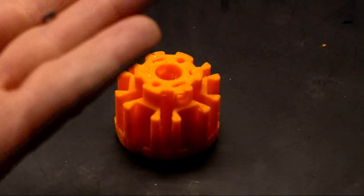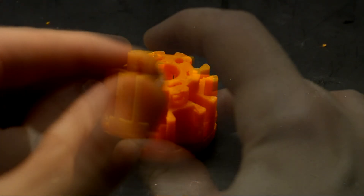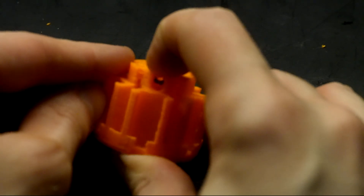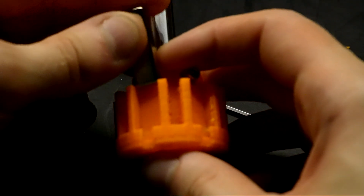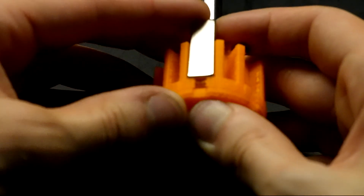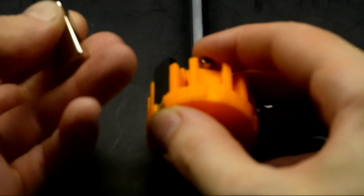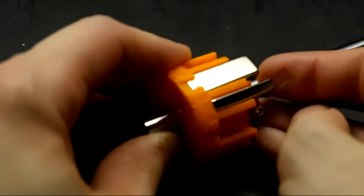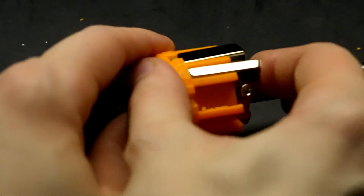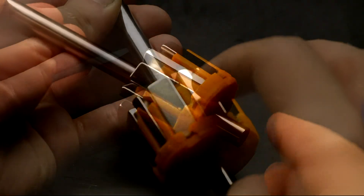The magnets I'm using for this rotor are correspondingly shorter. This shouldn't tangibly reduce efficiency or output, and it helps reduce the overall package size of the generator. Like the previous design, the rotor uses a Halbach array, which in plain English means arranging the magnets in the rotor so that it has a few very powerful poles as opposed to many weaker ones. Halbach arrays also reduce the amount of magnetism wasted by having half of the poles facing away from the stator, as in a regular motor or generator. The one caveat is that it reduces frequency, but it gives the rotor overall a lot more oomph.